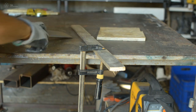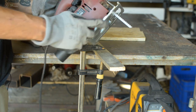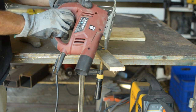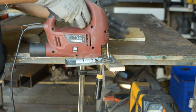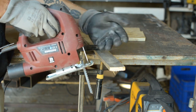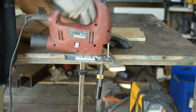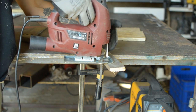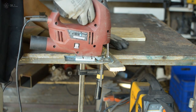You can also use the electric saw. The electric saw has a blade that goes up and down, and a trigger — when you press the trigger it moves. Always keep the piece from the outside of the workbench. The metal plate on the saw needs to be in parallel with the surface you want to cut — all the way flat, not tilted. Start a little bit before where you want to cut, so the blade is just outside, then press the trigger.